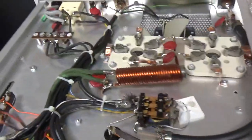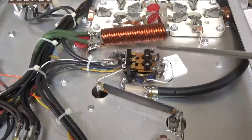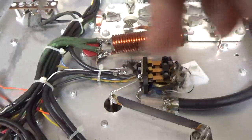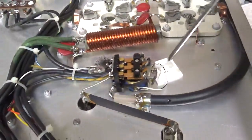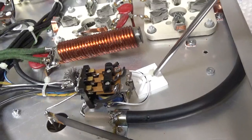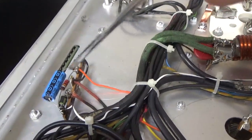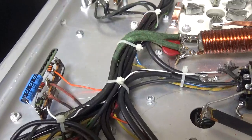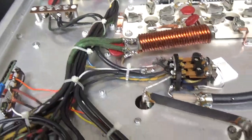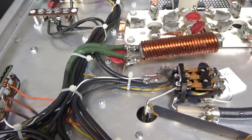Here's the bottom — I'll make this quick. Grounded the grids. Cleaned the input TR slash bias relay with Deoxit Gold. Gave it a self-bias modification. Ran a new wire from the terminal strip over to the coil of the relay. Put a sticky zip tie tab support in. Changed the electrolytic cap for the rectifier that rectifies the winding coming off the filament transformer. Zip tied everything nice. Tightened up on hardware. Fixed solder joints.